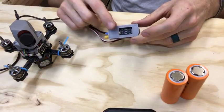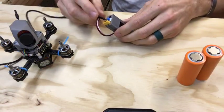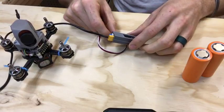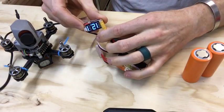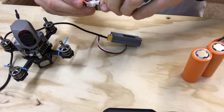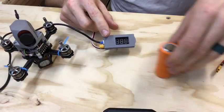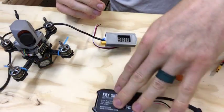This is a spoiler — this is going to be the lid for the case, and it'll have a voltmeter inside telling me the voltage of the pack. It'll also have a little switch to toggle the voltmeter between measuring voltage from the pack itself or from an external XT30 or JST. So I can just plug in a pack and it tells me the voltage — either from an XT30 or a JST Power Whoop 2.0. That functionality baked into the battery powering my FPV goggles is a great idea, because you'll always have a voltage checker wherever you go since you're always flying with goggles.